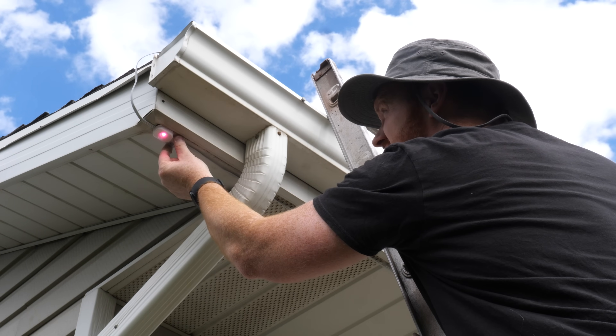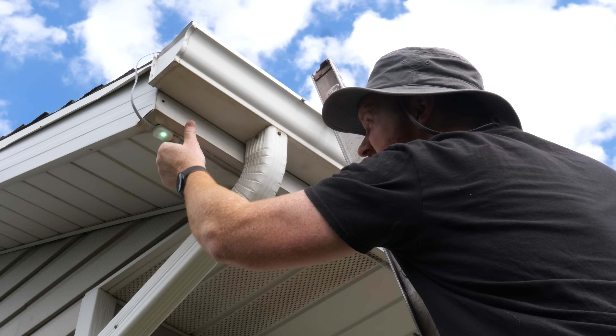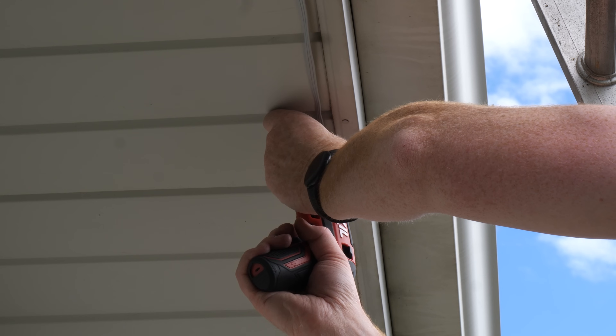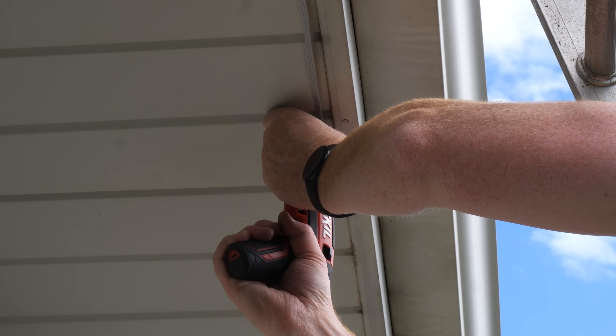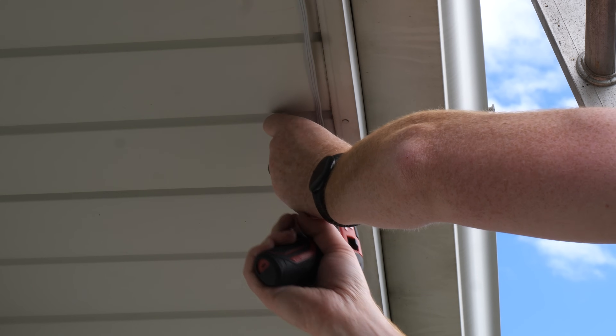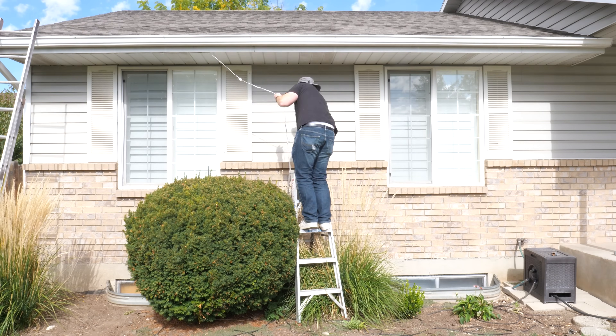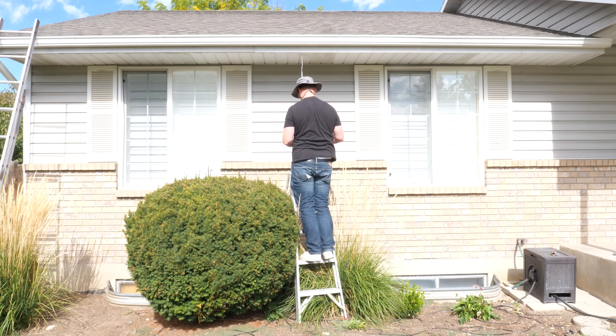For a full permanent install, this is where you add the clip and screw it into the metal soffit. You want to add these every two lights and around corners and other spaces — this ensures that if the adhesive fails, the lights will stay up. I'm now going to continue repeating this process for the rest of the strand.